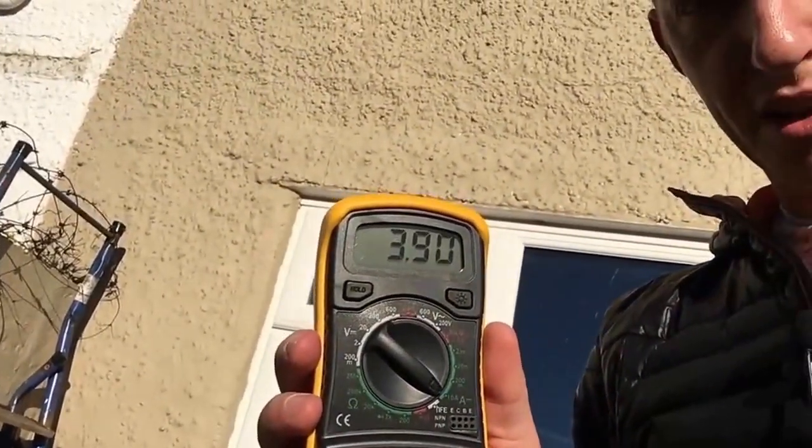Part of the issue is that the leisure battery is already full, so some readings are limited because the controller prevents overcharging. But doing open circuit tests, I'm actually plugged into the panel and as you can see it's pulling out almost four amps — and this is at two degrees in the middle of winter with not a cloud in the sky. It's operating almost at full capacity; it can pull 4.44 amps and we're hitting 3.91 right now at the Sun's highest point today.